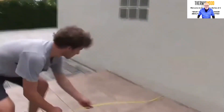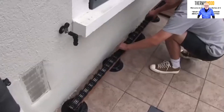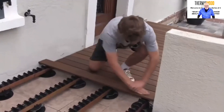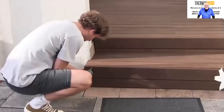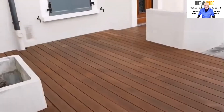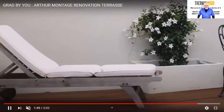For the second level, he installs pillars underneath the deck, lays the joist with the rail already lined up on top, snaps everything into place, and levels them all at the right spacing. The end of the joist makes it easy to screw in the front and cover it to look like a step. Using both feet to snap everything down, the result is a beautiful deck put down in a very short period of time with very little work — the clips were already installed, which really speeds up the process.